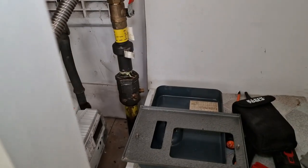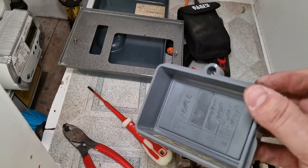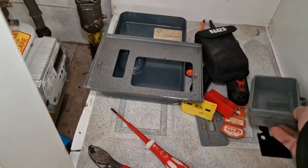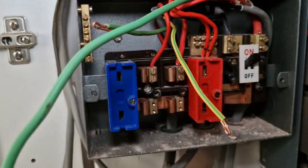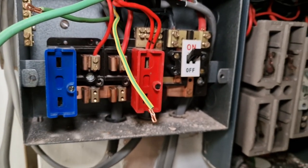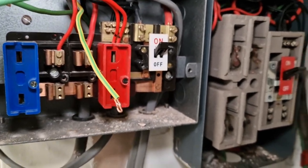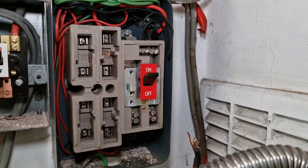This is from an older setup when we would have had storage heaters. If you see inside the casing here you can jiggle it out - you can see they've got the old storage heaters and they've been blanked off or converted to sockets. Somebody at some stage, because this one's the storage heater board, has wired in a shower onto this board, so obviously we can pop that into our new board as well.